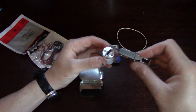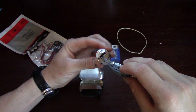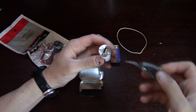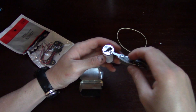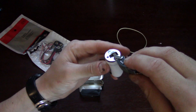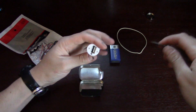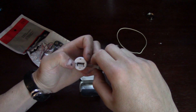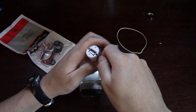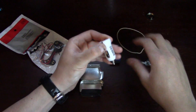The next step is to take apart the car charger. This one happened to have a little micro screw on the top, so I just used my Leatherman Wave to unscrew it. Then carefully take a tool and slide it underneath this little metal cover and pop it right off. From there, just pop this thing apart by putting your tool in the crease — it comes right apart.